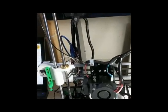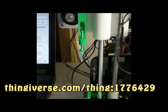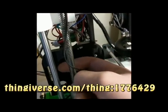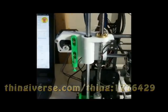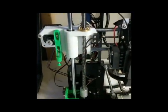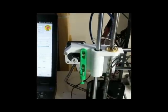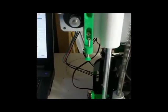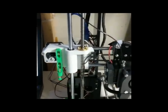The second mod was this here Lifter. Normally, back here, that's where the Z-axis limit switch would be, but it's kind of a pain to adjust, especially when you want to just barely adjust it. Like, when you need a difference between half a millimeter or even less than that, it's almost impossible to do. That's why I use this setup — I can just turn this little bolt right there with a screwdriver. It works much better.